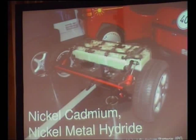Nickel-cadmium and nickel-metal hydride — basically the same. They use nickel instead of lead, but it's another water-based electrolyte, so it's the same. You can overcharge them slowly and the catalyst will take care of things, but it'll go dry.